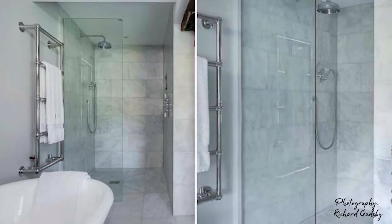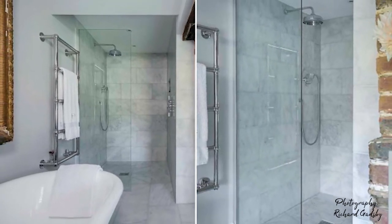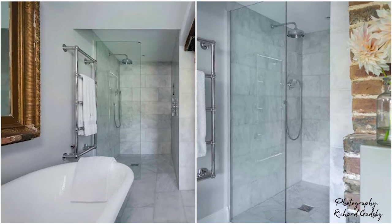Is it expensive to do that? My recommendation would always be to make sure that the area you shower in is completely waterproof, regardless of whether you have a normal shower tray or a wet room floor. If you compare those two costs, you still have the cost element relating to the walls, but the difference is in how you treat the floor itself. Assuming you do the wall tanking in both scenarios, the labour is slightly higher if you have a completely flush tray underneath the floor with a gradient fall — that is a bit more labour intensive — so the cost will be slightly higher than just purchasing a normal tray and installing it as standard.